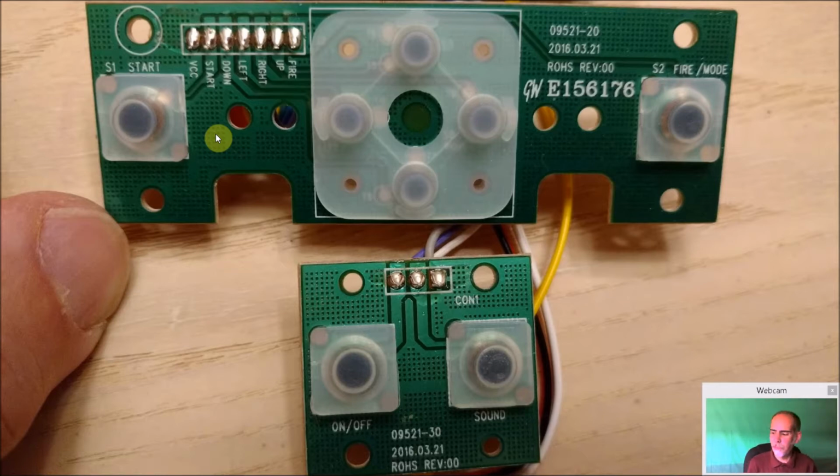And if you use the flux on there, which I highly recommend you use flux in any of this, put flux down first to help get the solder off. If you have a solder wick, the solder wick will absorb the solder into the wick and get the contacts nice and clean. That's probably the best way to do it. Or you could just heat the solder, pull out the wires, and heat the solder again and put the new wires in there. But again, always use flux. That'll help the solder flow easier and keep them on the pins and not damage and burn your board.